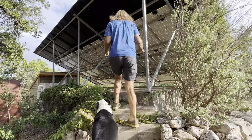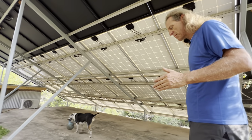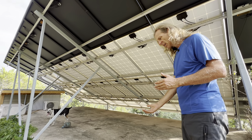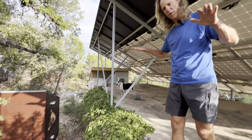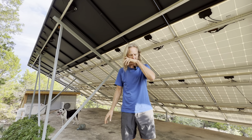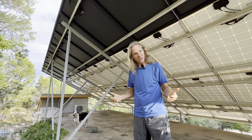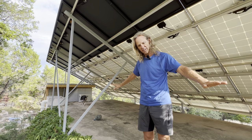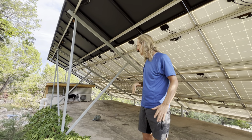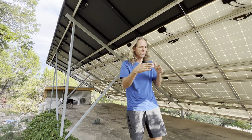This tank is all concrete. When we built this tank, we came in and cut down to solid rock. It's eight foot six inches tall, but that's only about four foot six inches above ground — we're about four feet down into the ground. The first thing I did was shoot a shotcrete swimming pool, basically. Nine inch thick walls, six inch thick floor. That's easy to form — you don't have to have two-sided forms that are very expensive; you can put one-sided forms and just shoot that shotcrete up against it.